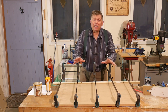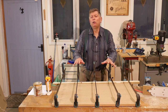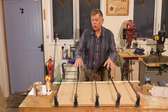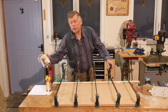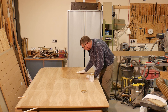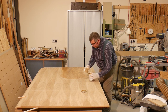The first thing is I don't want to have to do any more clean-up than is absolutely necessary. I certainly don't want to get glue dribbling all over my veneer and blocking the pores, because that will spoil the finish. So I've given the surface of the veneer a coat of hard wax oil before I've done the glue-up — in fact I did it before I even cut the boards up. I did the whole sheet with a coat of hard wax oil, and that seals the pores so if I do get any glue on there, it will be easier to clean up.